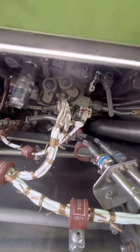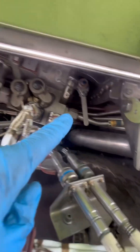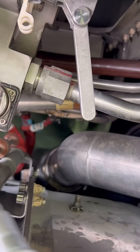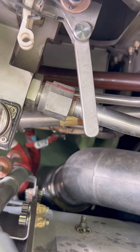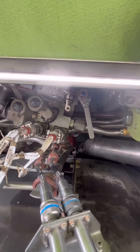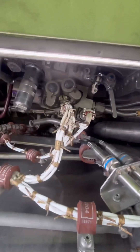This is how it looks when it's deactivated — you can see the pin and the lever is in the deactivated position. Our HCU is now officially deactivated, which means the hydraulic system has been cut off from the thrust reverser. The hydraulics are what actuate the thrust reverser itself through the HCU, so once we deactivate the HCU, we cut off the hydraulics from the thrust reverser.